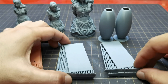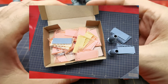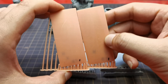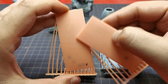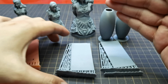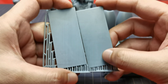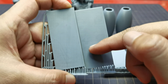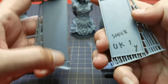Now I have here the print result for the stability torture test on the Frozen upgrade kit. It's a good thing I always keep all my test prints. This is the very first stability torture test I did on my Sonic Mini 4K, even before I fixed the wobble lines with the Highwind guide block and rail. You can see the wobble lines here, especially facing the X-axis. When I reviewed the footage I could see the whole Z-tower leaning during bottom exposure. This is the first stability torture test after the upgrade kit — I have bad print lines here because I forgot to lube the lead screw.